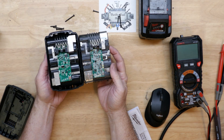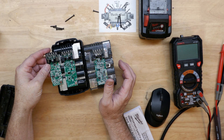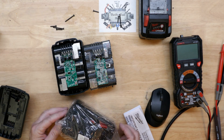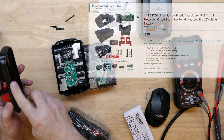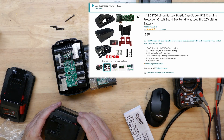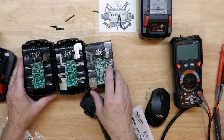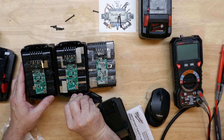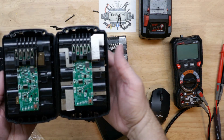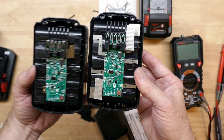Well, there you go — this is definitely not a Milwaukee board. The board layout is not even close; it just performs the same function. If I bring over an aftermarket board from like a five amp hour, you see that red push button — very common with these aftermarket boards and a similar design. I just got in the 8 amp hour kit I mentioned in the last video, which I think has the same clamshell top, so let's compare. This is the 10-cell 21700 kit at about $25. Wow — that board is identical. The one we just bought off Amazon is identical to the aftermarket kit board.